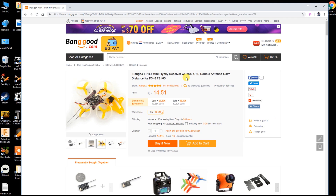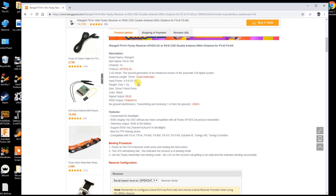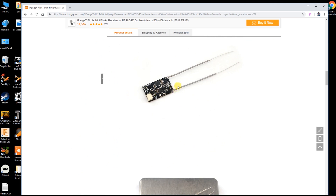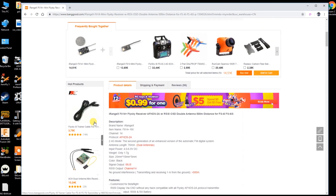So your radio will know what the reception quality is like. And it can relay the voltage the receiver receives, which is kind of useless. If you run a nitro plane or a gas plane, then that will be useful. But in all other instances, if you fly FPV quadcopters or electric planes, I don't see the use for battery voltage from your receiver being available in your transmitter. So this one is nice and small — two antennae — should be a very good option for drone or quad pilots flying with FlySky systems.